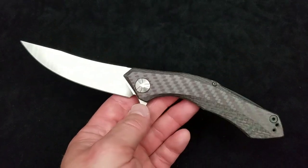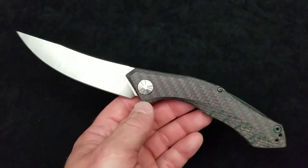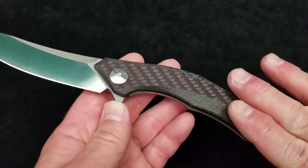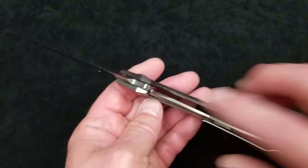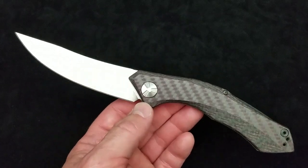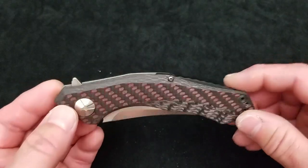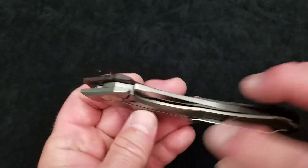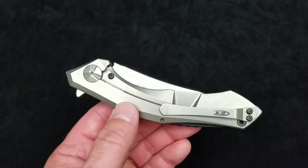It was circa 2008, and I really liked that knife. It had some issues. It was super thick behind the edge. It's not a slicer. It was a cutter. But it was heavy, mine was black G10 and then flame finished bead blast titanium frame lock. And it developed significant lock rock within months of carrying it and using it for just common use. Unfortunately, Strider Knives had developed a little bit of a reputation at that point for that problem. And it was an ongoing issue with titanium. Titanium is soft, guys. You cannot harden it as hard as steel.